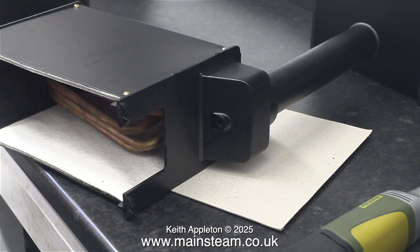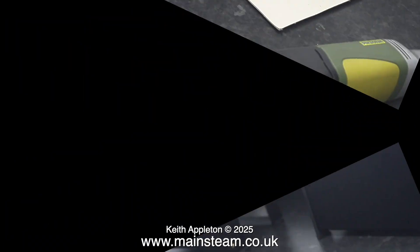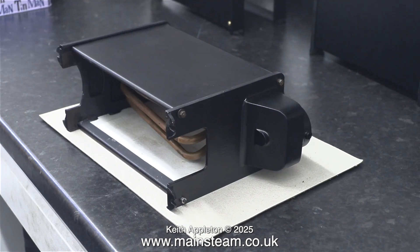To show the difference, here is a 504 chimney that's already been drilled. Can you see the hole? It's a quarter of an inch diameter for quarter pipe. I need to drill these holes in the 501s to take three sixteenths of an inch diameter pipe, and as I don't want to damage the paint, I'm not going to risk putting them in the drilling machine.